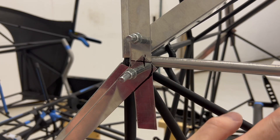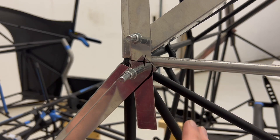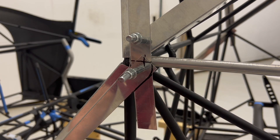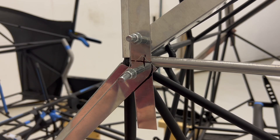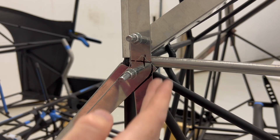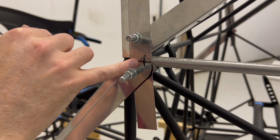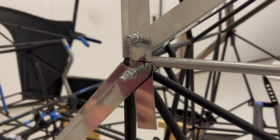While I was looking at this junction here and the one on the other side, I remembered that there is this stringer piece that gets attached to the side of the fuselage and then comes in here and interfaces with this junction. So I got the stringer out and roughly hung it where it's going to be and wanted to see exactly where it was going to interface at this junction. I'm really glad I did because as you can see here it's a little bit tight quarters. I've made this little black curved line showing what I want to trim off as my curve, and then these two straight lines — horizontal and vertical — show where the rivet is going to need to go for this stringer piece, right where they intersect.